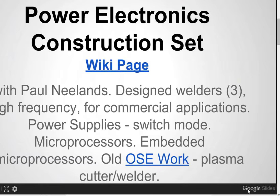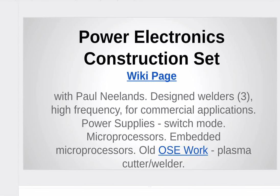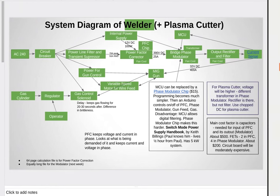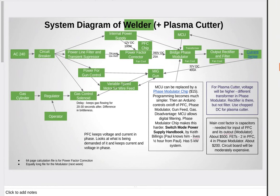As far as 100 watts inefficiency, what does that translate to for the overall power supply? What's the industry standard figure? In that range. So if we're using 10 kilowatts in a welder, you have 1 kilowatt of waste power that will be handled by fans.